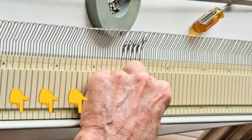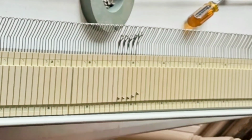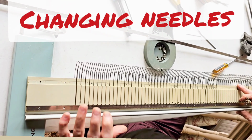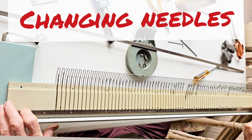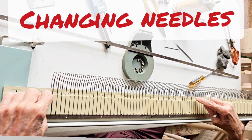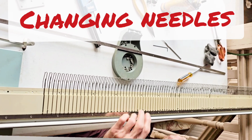This worked, but it would be simpler just to put in the back strip, then the needles, then the front strip. You can leave this back bar in to hold the bed sections and the end plates in place. You only must take this bar off to change a needle. And it's still a dozen screws, but it's not impossible. Not that big a deal.